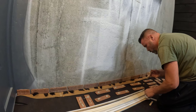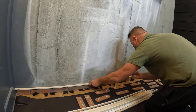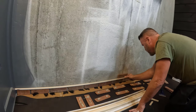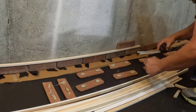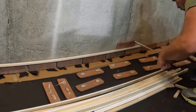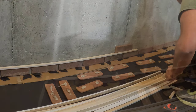All we're going to do is eyeball the first one, put a strip in there, and go this way first. I like to double-check this first one because it's hard to see where it lines up. I've got two coming in, so let me get a tape measure. These bricks are roughly seven and a half inches long, so I need about three and three-quarters — come right on the center line. Close enough.